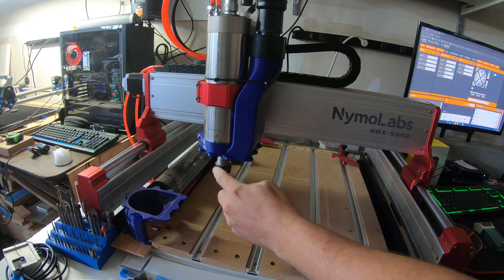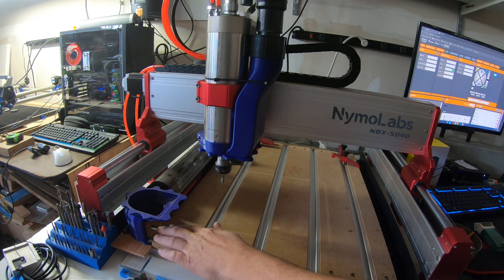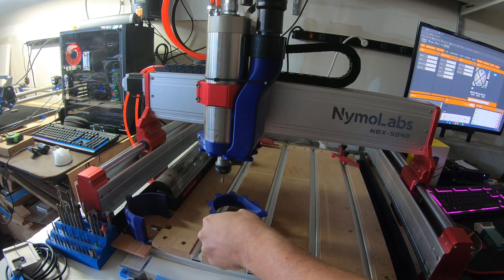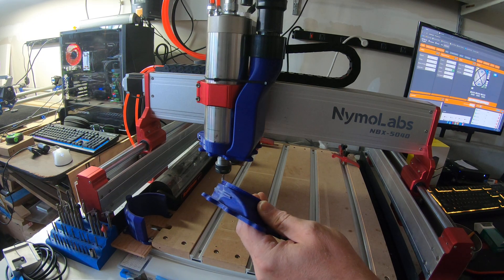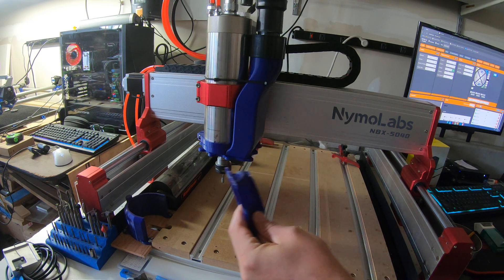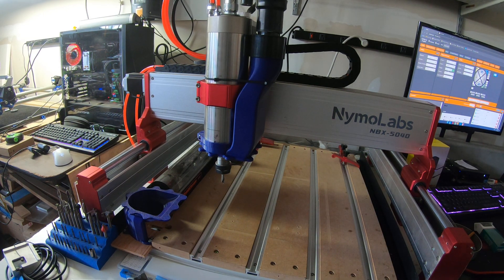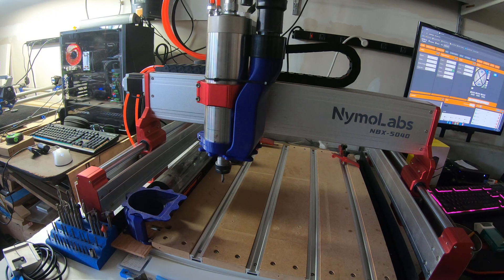So it wouldn't hit the ATC when doing tool 1 or tool 6. I had to augment the base down underneath and put a spacer in so that when the bit moves — about 28 millimeters from center when loading — the dust boot would still work. Everything works. The only thing missing is I'm waiting on some brushes to arrive. I'll probably do a 30mm and maybe a 40mm that I can attach separately, depending on what tools I use. The largest bit I use is about 40mm, though I usually don't cut anything over 20mm.